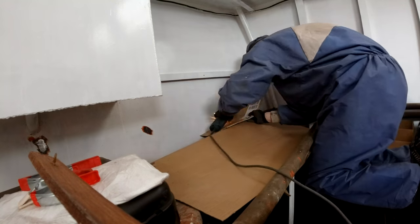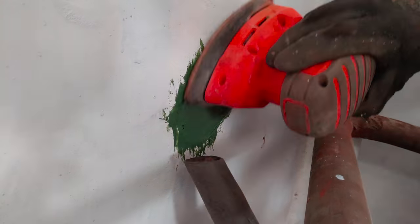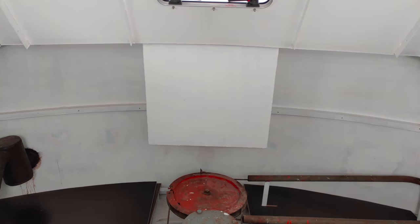I had to do the same thing on slightly fewer areas back in the aft cabin. There is still this hole here in the rear, which was closed off by the previous owner, so I filled that up with glass fiber filler paste. I had to do a couple of rounds of glass fiber paste on this one. Sanded everything down. Gave it a coat of anti-corrosion spray, just in case. Applied some fine grain filler paste, sanded that down, and then a final coat of paint. The aft cabin will get another entire coat of paint eventually, but that's where we are at here for now.